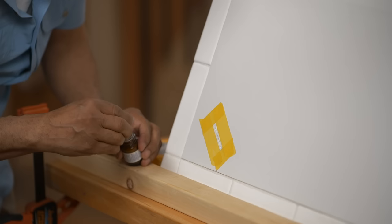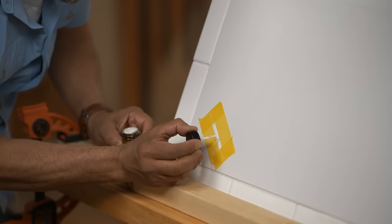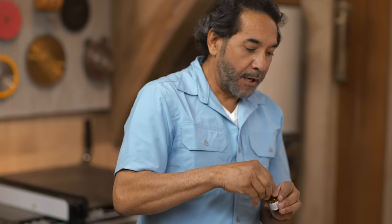They've got other colors you can order. What if Grandma's pink and avocado tile scheme needs to be repaired — can I make a mix? You can. If you can't find the color you need, I grab a little bit of oil-based stain, because it's all solvent-based, and just drip a little bit, working on it slowly until you get the desirable color. For pink or green, you'd find some pink or green oil paint — that would work.